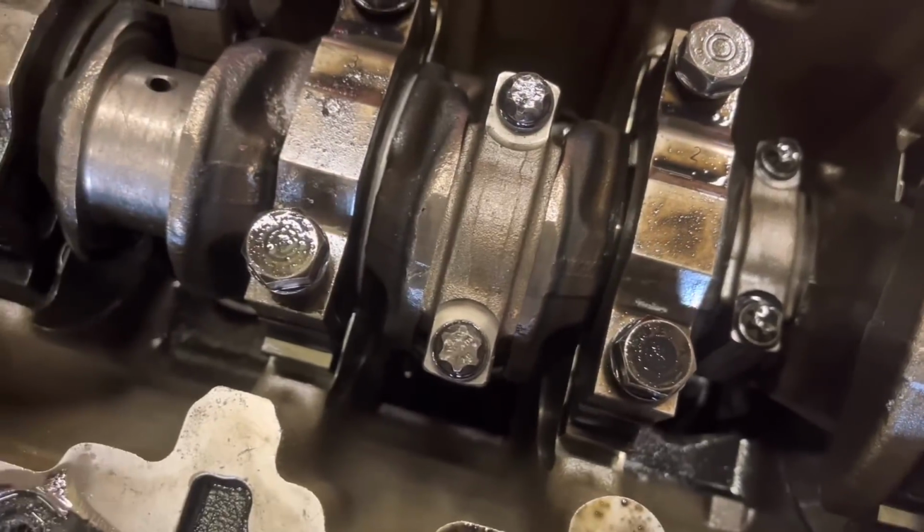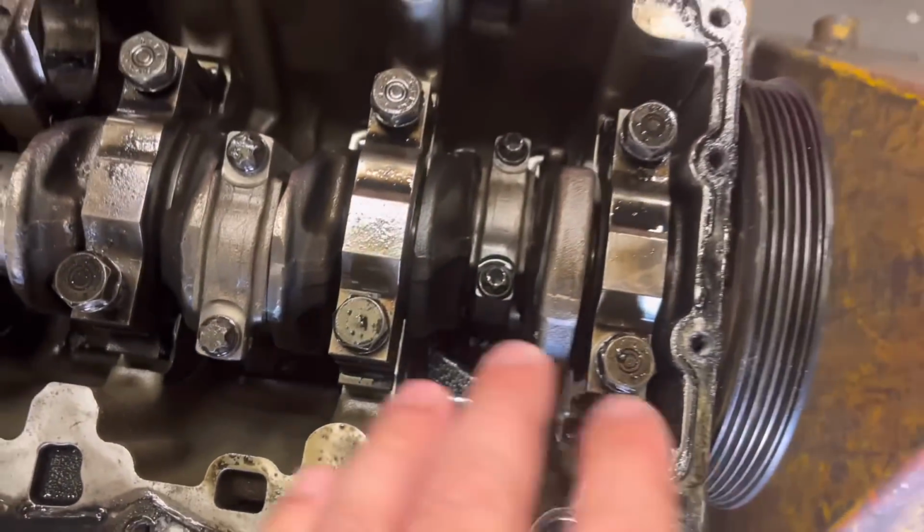Lovely guys, really nice to meet them. They were hoping that if they dropped the engine down here, we could have a look, regrind the crank, new bearings, etc., and go from there, really. But on closer inspection, and this was just in the back of their van, I got them to take off all the mains to check them.